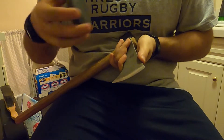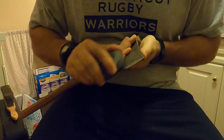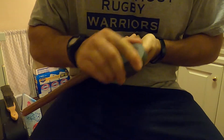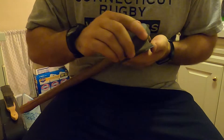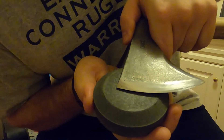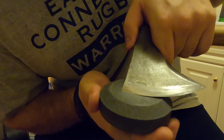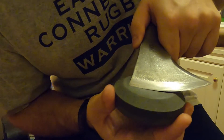The fine side is going to bring those scratches even closer to being polished. It's really important to keep your fingers out of the way. Watch as you go back and forth and see where those scratch patterns are — if you're too far back you're going to be sharpening too far back on the axe. Basically, I start sharpening until that gap closes.